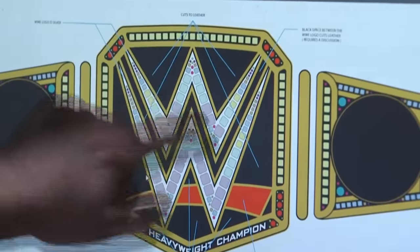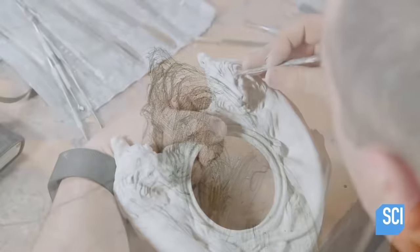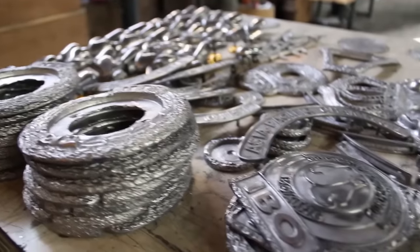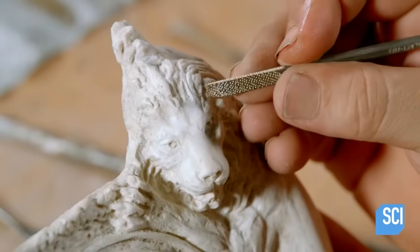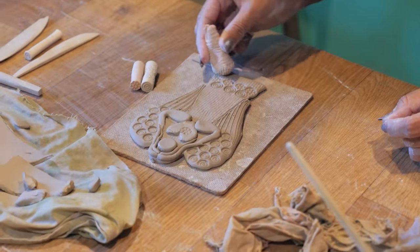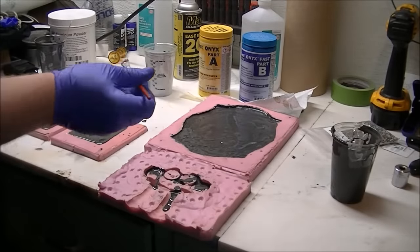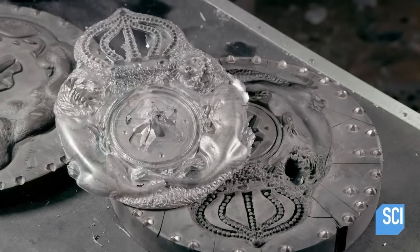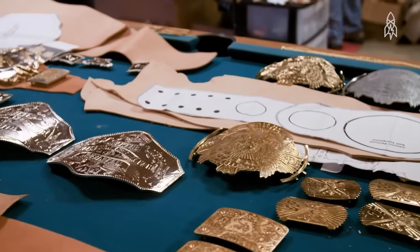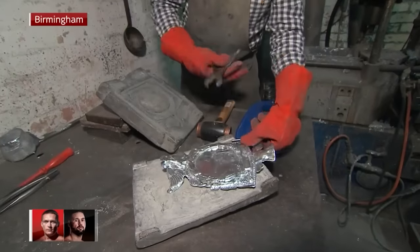As important as 2D designs are, they're pretty useless if you can't translate them into 3D. The belt makers move on to basic modeling of the belt design, both to visualize the design in three dimensions and to start working towards a mold that will be used to create the metal plates. First, soft clay is used to create a highly detailed model by hand before letting it dry and become solid. They then use plaster to form a mold around the clay, which once solidified can be separated from the clay model. This plaster mold is used to make a soft metal model from aluminum or other easy-to-model alloys. The artist spends a lot of time cleaning out rough edges and perfecting all the relevant details before this is used to create a final metal mold that casts the eventual plates out of molten tin.